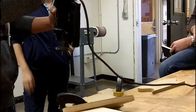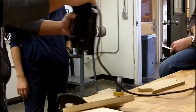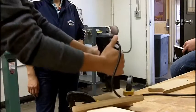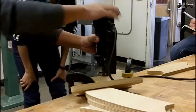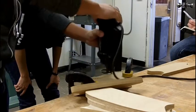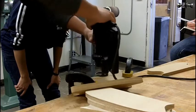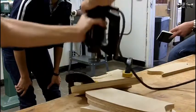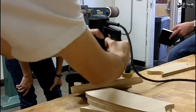Without the handle it's actually a little bit harder to control — you don't feel like you have much accuracy. Your hands are closer so you have to look away to get a better view. With the handle your hands are a bit further apart, you can actually see the drill bit, and your cut is better. You could see that when you had no handle you started rocking a little bit. So the handle is definitely a good idea — if you're holding it close, your arms block your view and when you move out to see, you lose accuracy. I feel like without the handle you're losing a lot of leverage — the two contact points are close together so all the control is concentrated in one small area.